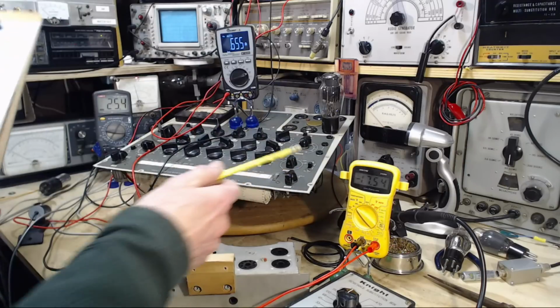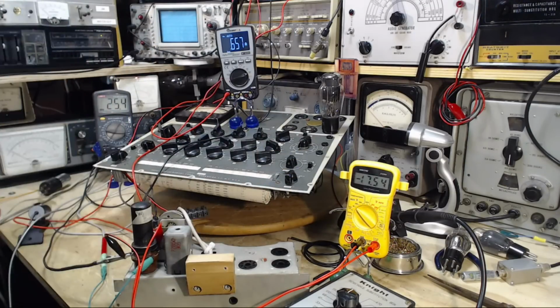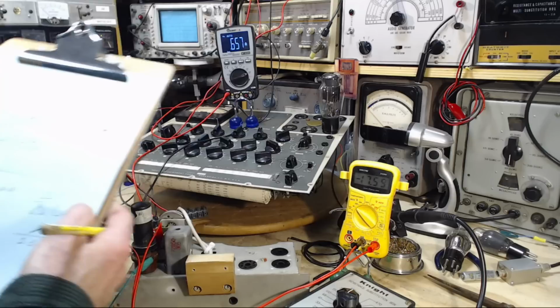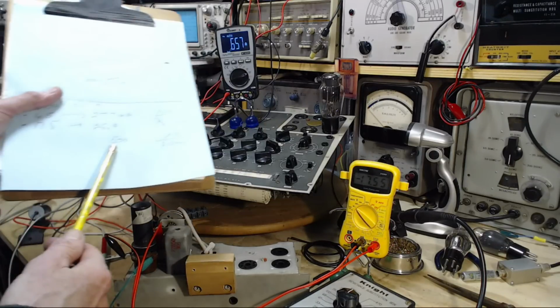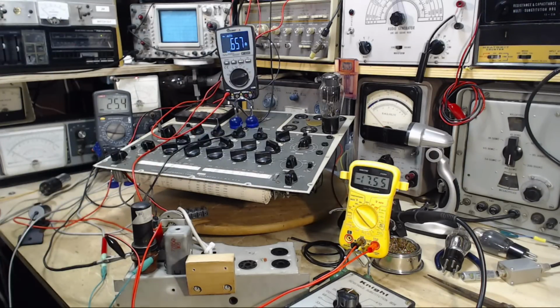But in the tester, it measured 2,000, and I believe it measured 1,500 in this one. And the GM is supposed to be 2,500. So am I now to say, oh, this is a 500 tube, we'll use that from now on? No. I am to say nothing and continue on. I got that result. I did that at 200. What if I do it again at 250?